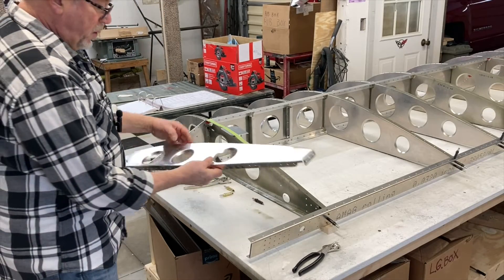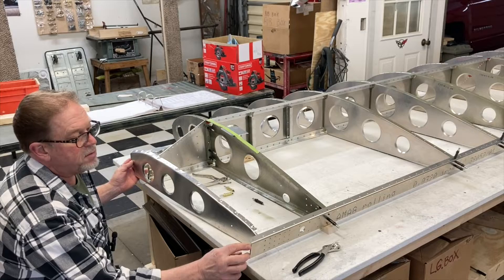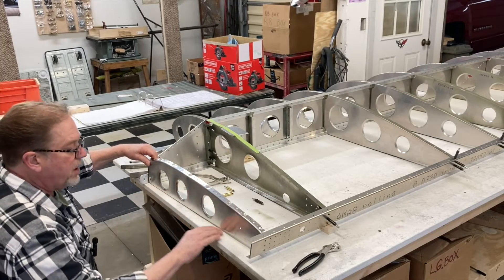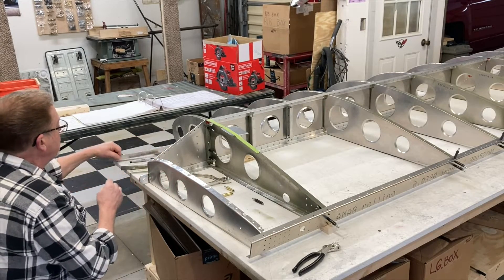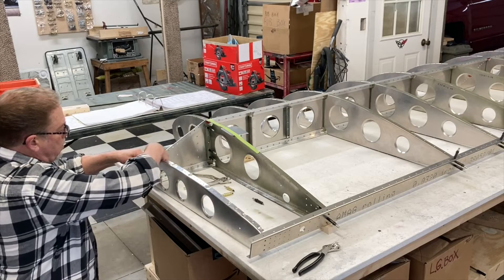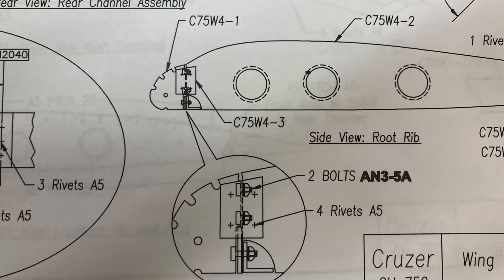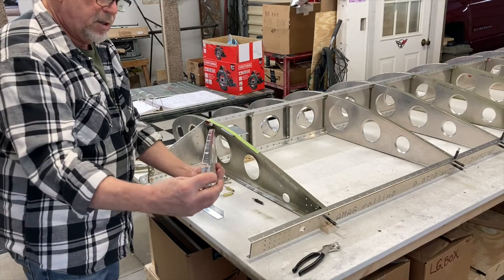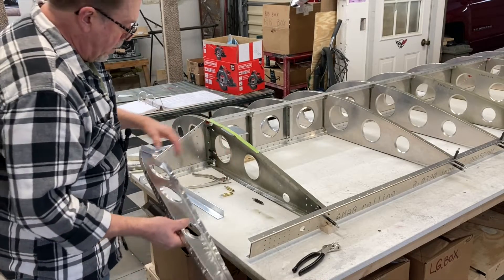The reason I set this up this way is so that I can get — oh, just look: if you're going to do this on yours, make sure that the back doubler is in, because that sets us forward. It's slightly arched, but according to the pictures, this is supposed to be level with this edge, just about touching in the front. I've made sure this was good and square, and fluted it slightly to get it nice and straight, because that did change how it fit on the plane — it was bulged here and wouldn't let it get down close enough to the table.